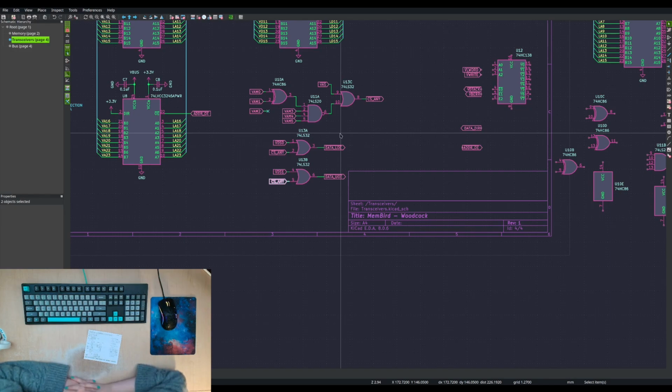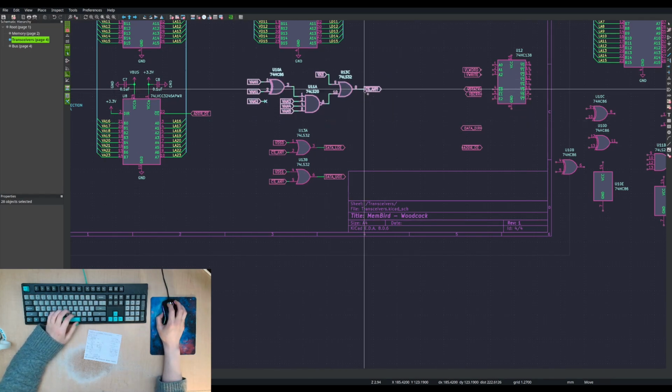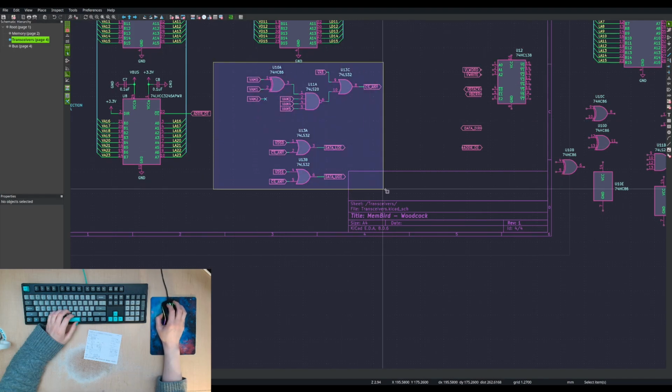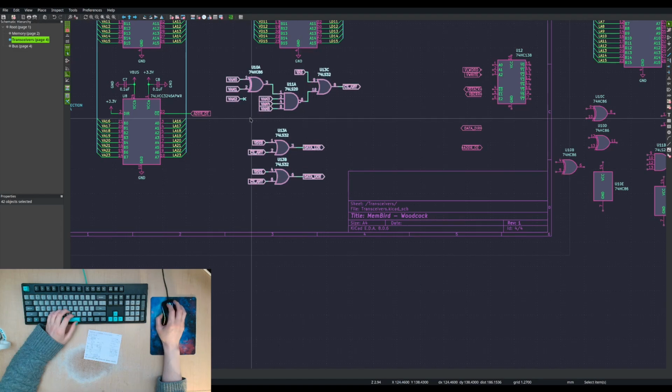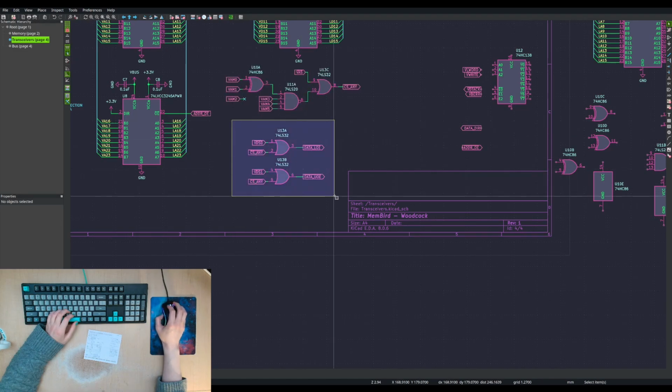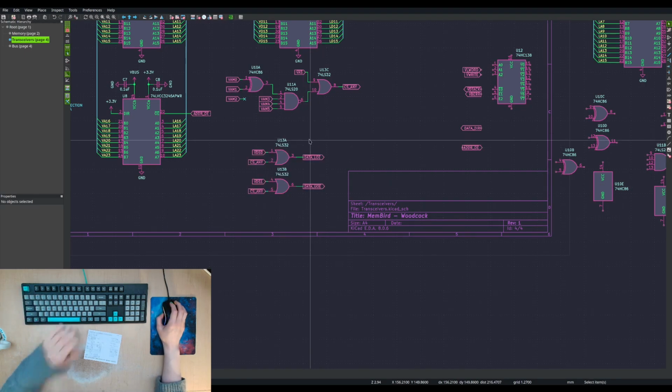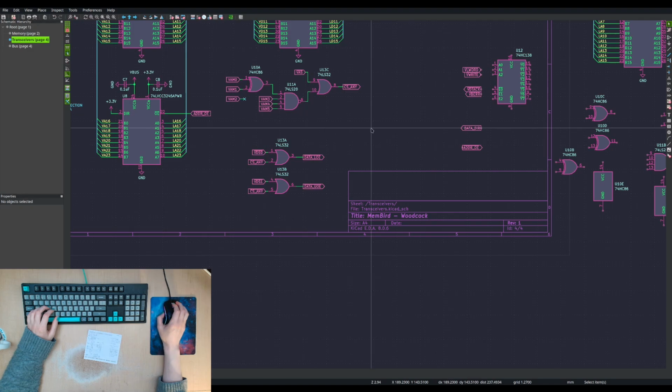Well, a 2-bit comparator would allow for 4 megabytes. We could have more and not populate it, because I'm probably not going to put all 8 megabytes on this board, because I might not even use this for long. I might end up making that a DRAM board, do it that way. So I need a 2-bit comparator.